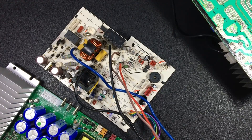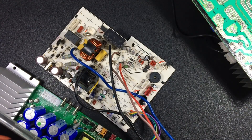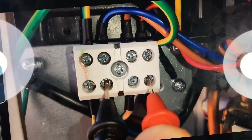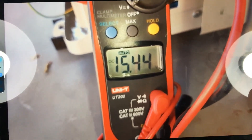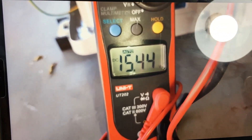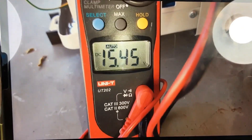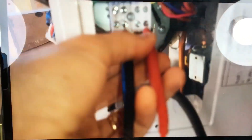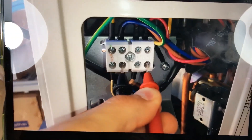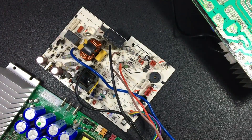If you find any problems, you need to check all of these pieces. I will show you a measurement on a working unit as you would do at the customer's home. We will measure with the multimeter between S and N. Directly from the outside we can see if the communication is working or not. We have the same values we saw on the test bench — 15, 4, 20, 15, 15, 4, 20, 15 — constantly a voltage that goes up and down. Always test between N and S.